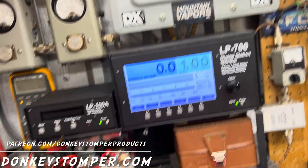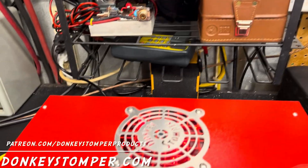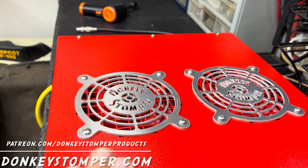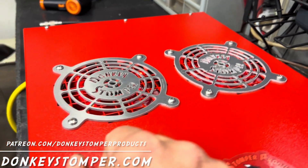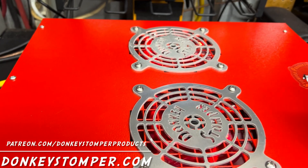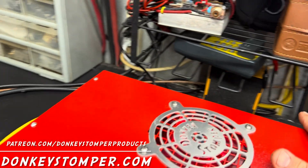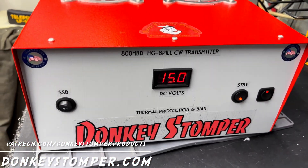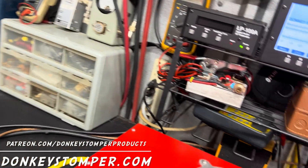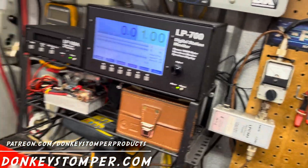The numbers may not be textbook correct, but that will show you where you need to be so you don't blow your finals. The guy that blew this — he blew one transistor, a new build — said everything was going good, he was on sideband on his Icom, he whistled a little bit and smelled smoke. So I went ahead and pulled the one beside it and put two in there. For something like this, I'd set my Icom on sideband like 25 to 30 percent and look for 500 watts average — and that'd be it.